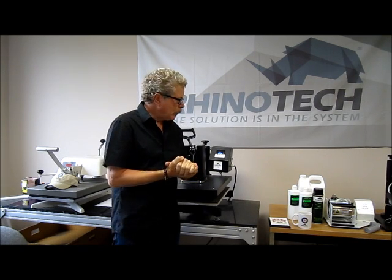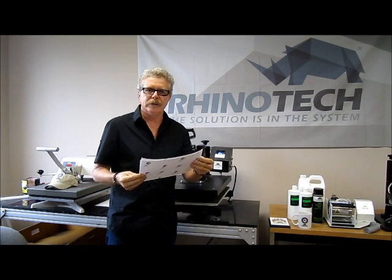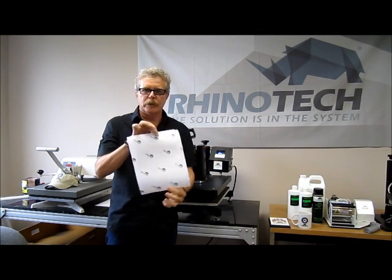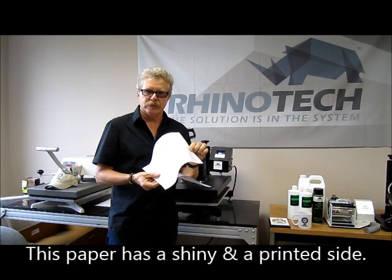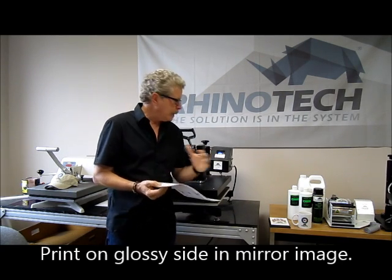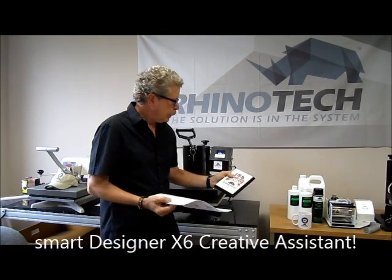He's made a number of nice comments about that product on our Facebook, and we greatly appreciate it. When you look at this particular paper — which comes in 8.5 by 11 or 11 by 17 — you have an extremely shiny surface side and an imprinted side. We create our artwork and print it out on the glossy surface. It has to go in mirror image so that when we put it down onto the surface of our plaque, it will be right-reading.